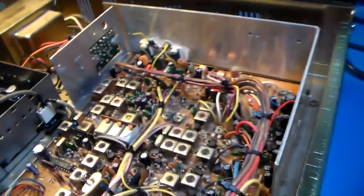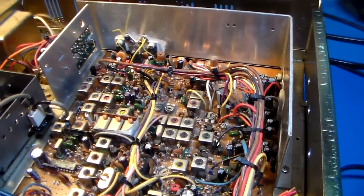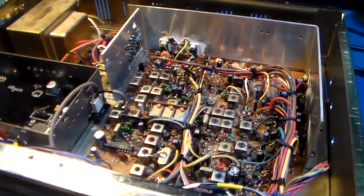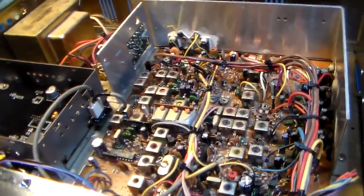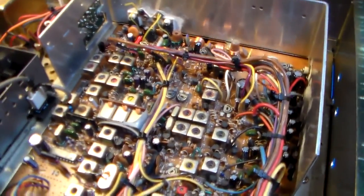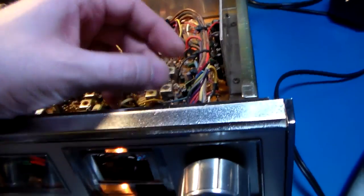Radio needs an alignment. It's doing pretty good. We're doing negative 80 and negative 90 dBm at 25 and 30 megahertz. Radio's doing pretty good. It's much more sensitive than that, obviously, at 27 megahertz. It's negative, I don't know, negative in the hundreds. I can't recall where exactly. It's pretty good though. So that said, that's basically all there is to show. I had to work this out because that was a channel selector, obviously, in the display.